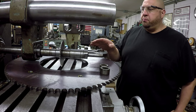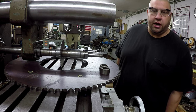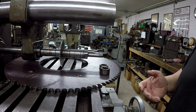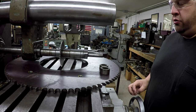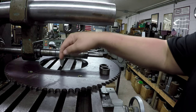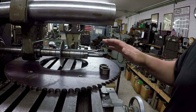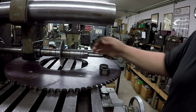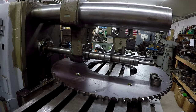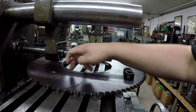I've been getting the arbor set up - sometimes it takes a little while to get this done. There's a couple things happening right here whenever you set up. You got to make sure that you got your proper clearance - with this cutter here I know I can clamp this down and cut through the whole thing and still clear on the bottom of these arbor supports. I had to move the saw out here so that I had enough room for the sprocket to clear the spindle back there. I want to use the middle slot so that I can clamp evenly on both sides.